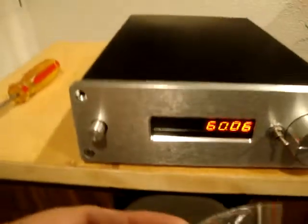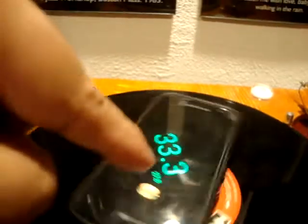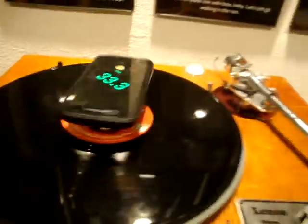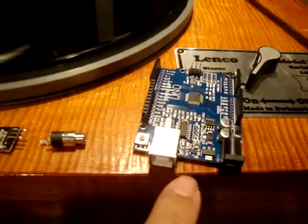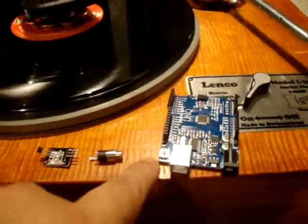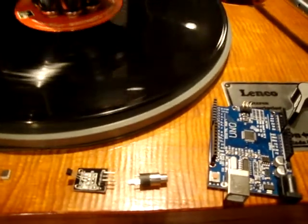I already bought the tachometer that's going to fit right next to it. What it does is read 33 RPMs — right now I'm using my phone every time I go to the turntable, reading the RPMs like 33.3 or 45. I've got a magnet, a sensor, a barrel, and an Arduino board. I just need to find a program to tell me the tach. The sensor connects to the barrel, and the little magnet gets glued on the inside — every time it does a rotation, it gets read.